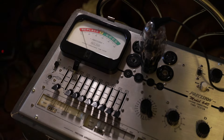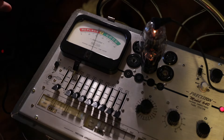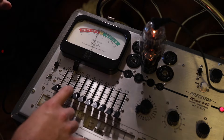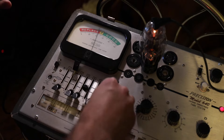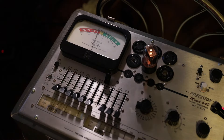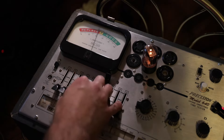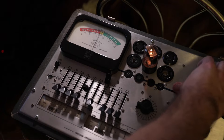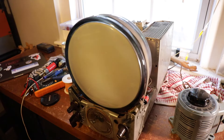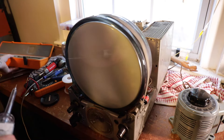All right, I see filament voltages starting to come in. We're at 100 volts, 53–54 watts climbing. It stopped at 68 watts — but it should be higher than that, especially when the high voltage kicks in. So I'm testing the 19BG6 horizontal output: no cathode short, and that tube tests very well. Testing the damper 25W4 — no shorts, tests good. The 12SN7 also good.